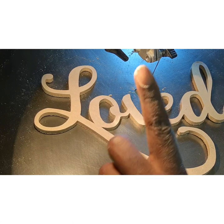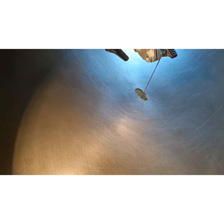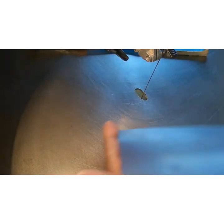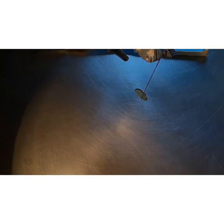I did a video a few weeks ago that talked about little pieces slipping through the hole of your scroll saw. I usually take a playing card and I tape it to the table and drill a hole through it so that I will have zero clearance, meaning nothing will fall through there. Well, Colin said I could also use a dry erase magnetic sheet. And that's what you're looking at right now. It's completely magnetic and you can write on the white side. Well, let's try it out.